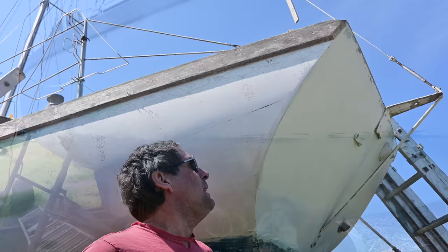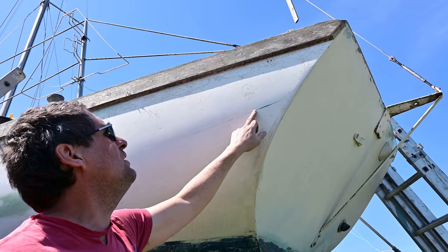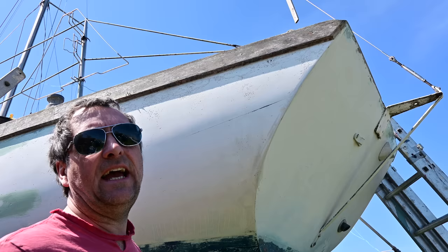I'm going to start filling this hull now so that I can get ready to paint it. So I want to fill these pitted pieces, and a different thing just where the odd plank has sort of opened up a little bit, hardly anything at all, but I'm going to put putty in there, sort of normal linseed oil putty, which will not dry incredibly hard, so that if the boat does decide to take up, it can squeeze it out. It won't compress it too bad. Whereas this stuff will be quite brittle.